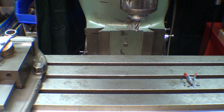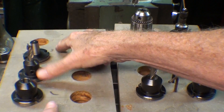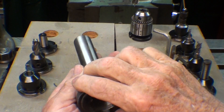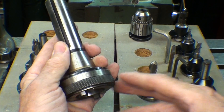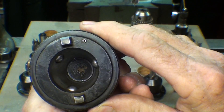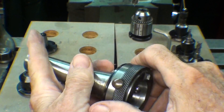So now I'll show you what I have in stock here in my own selection. I do not have all of them, but even what I'm going to show you is thousands of dollars worth. It was a gift to me — I could never afford this tooling. I made these plywood tool holders, copied loosely from what you see in the catalog, to hold these. That's normally kept in the spindle of the Bridgeport. These are available, as far as I know, only with an R8 shank. This is called the Easy Change Body. You won't be able to see the inside of it once I mount it into the spindle, but you can see how that's made with three balls, and there's your release, your drive lugs, and so on.